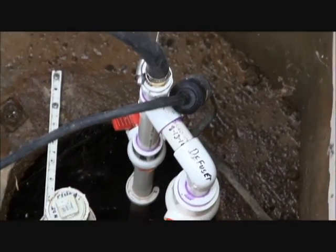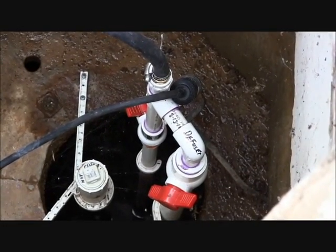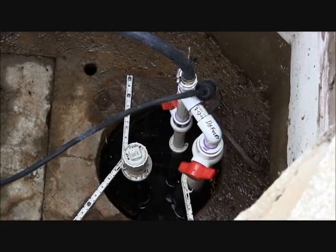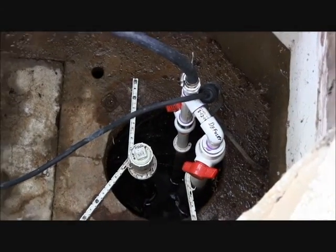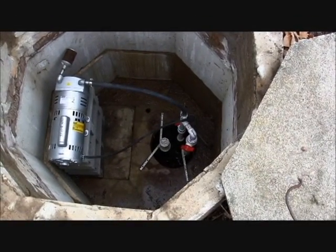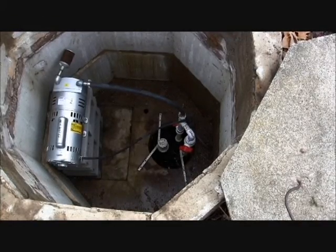The air line is divided to the two treatment components: the primary diffuser, the larger line, and the return line, the smaller line. The primary diffuser goes into the water, forms a cross with holes drilled in it, and as the motor runs, pumps air into the system. This helps to circulate the waste and feed oxygen to bacteria which will treat and break down the solid material.